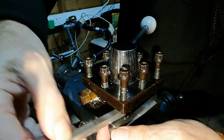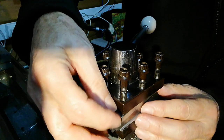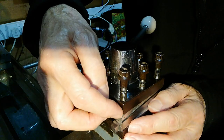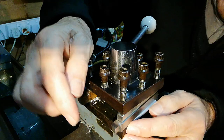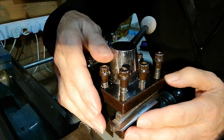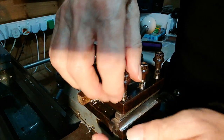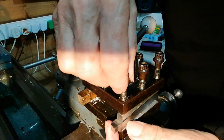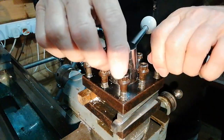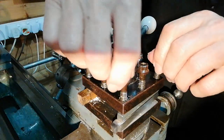Put this on here like so, and clamp it over within the limits of the slot — you're not clamping over and above it. I always want to leave it at a slight angle there, because it suits my purpose, and you'll get used to doing it how you want it — but this is a good start. Clamping it there. It's always best to use some steel packing above it because it also gives it support. We don't need to tighten the third one there, just do it slack. That's it — that tightens that.